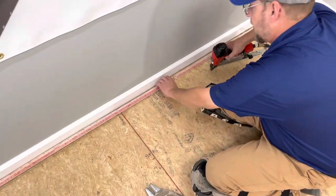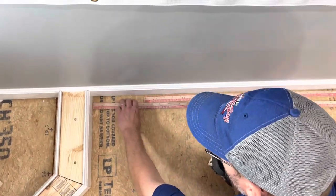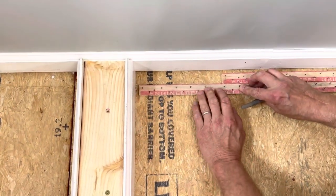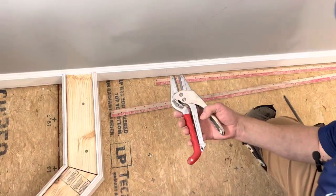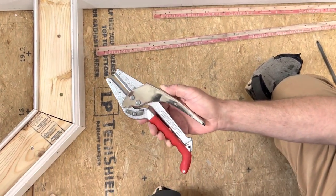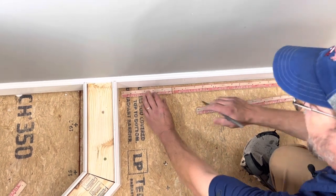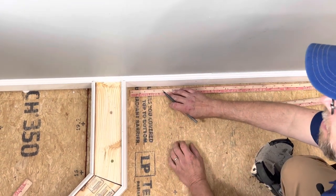I've got about a quarter inch gully. I'll take my very next piece and butt it right up to the first one, positioning it exactly as it needs to go and spacing the end correctly — about a quarter inch gully from the end. After I get it lined up, I'll take my ink pen and mark it. I'm using tack strip cutters; if you don't have those, you can use tin snips. Marking with a pen keeps me nice and consistent and accurate, so I know I'll have a perfect size gully on the end.